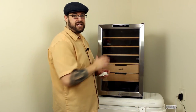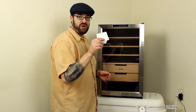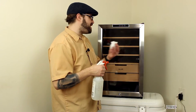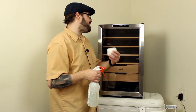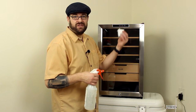To season this, just like any other humidor, you want to take a piece of clean paper towel, a new sponge, or a clean rag and distilled water. Then you want to basically rub all the surfaces of the Spanish cedar down to get some moisture into them, because they are super dry right now and they're going to suck up a lot of moisture.